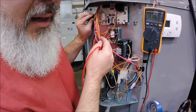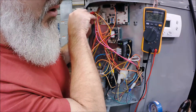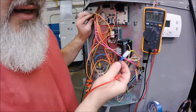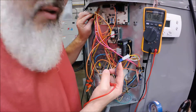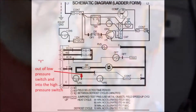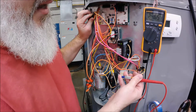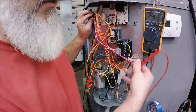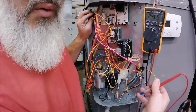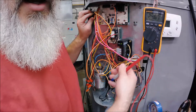Following the circuitry, next is the low pressure switch. This yellow and pink wire coming from the board leads into the pressure switch. We know it had 24 volts going in - now we want to make sure the pressure switch passed it through. You look at your diagram and physically find where the low pressure switch connects to the next safety. In this case it connects directly to the high pressure switch, so I check right at that connection point versus common.